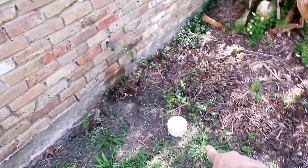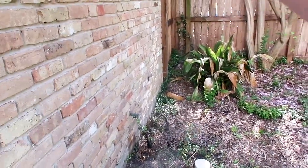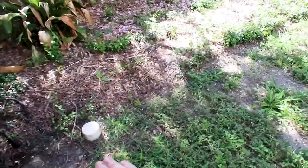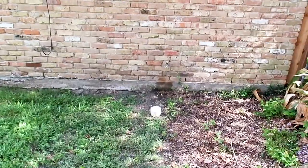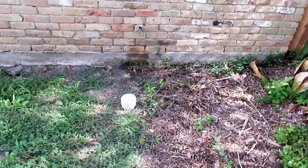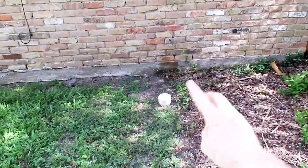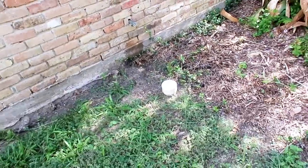We have another cleanout in the back of the property. Judging by the cleanout over there, one a little further down, and now one here, my guess is the sewer line goes that way. Because we have prior repairs, some settlement issues inside the property, and cast iron on the other side, I'd still recommend a sewer scope scan or hydrostatic test because we don't know if they went all the way underneath. Ask for the paperwork to see what's been done, check for warranties, or get the test done — you don't want to end up with a $20,000 fix underneath your structure.